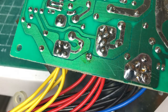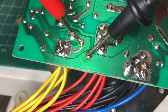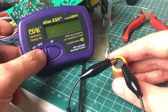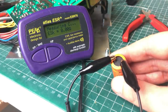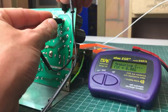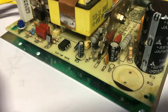Doing a continuity check with my multimeter on the pins where the capacitor used to be, I'm still getting a short, so the problem is elsewhere. With the capacitor out of circuit I checked it with my ESR meter. This is a 2200µF capacitor rated at 16V — the ESR is good, but it's measuring slightly higher capacitance at around 2700µF. I don't think this cap is the root cause, as older caps can have up to 20% tolerance. The big bulk capacitors in circuit also measured perfectly fine.